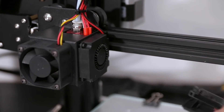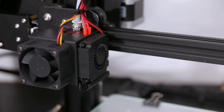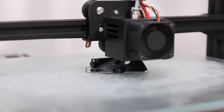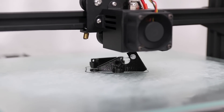I also printed this small adjustment to the part cooling fan. The part looks almost exactly like the original but it has a little slope inside so it redirects the air more downwards instead of directly onto the hot end. And I almost forgot about the filament guide by the extruder — normally the filament is almost touching the threaded rod that moves the z-axis up and down, which is greased up and kind of dirty. So it's just a little clip that clips on there and allows you to route the filament a little bit further away.